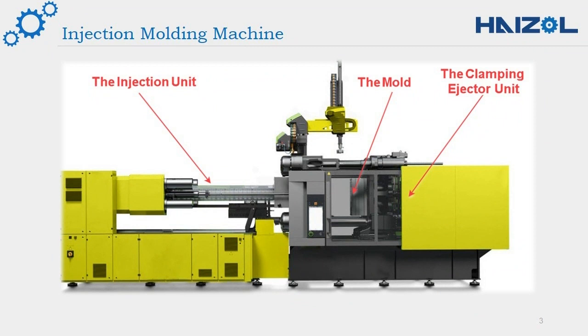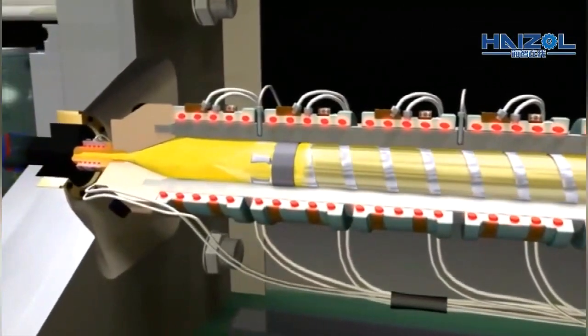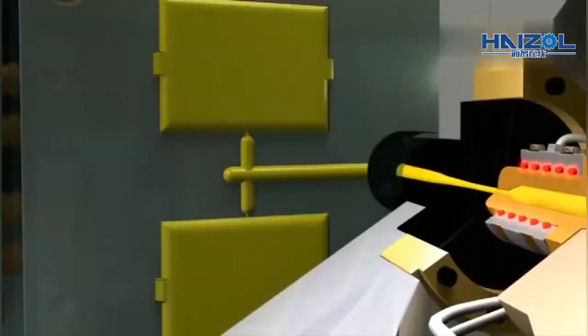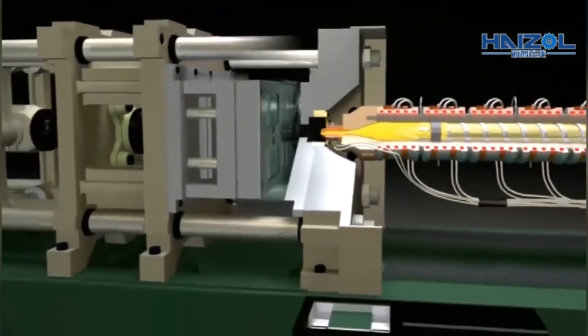Can you explain a little bit about how an injection molding machine works? An injection molding machine consists of three main parts: the injection unit, the mold, and the clamping unit. The purpose of the injection unit is to melt the raw plastic and guide it into the mold. It's a unit where a screw moves in a cylinder to inject molten plastic into the mold. The screw carries the pellets towards the mold and at the same time compresses them. The force from the movement of the screw makes 60 to 90% of the heat needed to melt the plastic pellets.